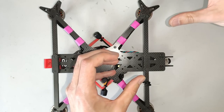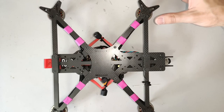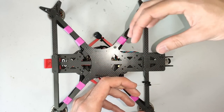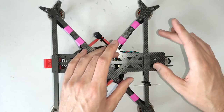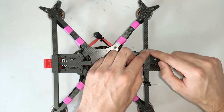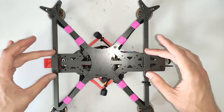There are also really nasty vibrational modes that get much worse as frames get larger — where the motor is twisting back and forth on the end of the arm. Having this triangular truss structure provides that wide base and prevents that twisting mode from occurring at the low frequencies it would with traditional 7-inch frames. You get much better vibration and resonance performance with this design, and that's only increased by having the aligned carbon fibers on both struts. There's a front brace, a rear brace, and a central brace — the same layout as the AOS 5.5.